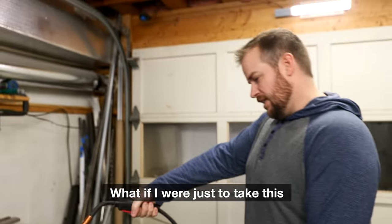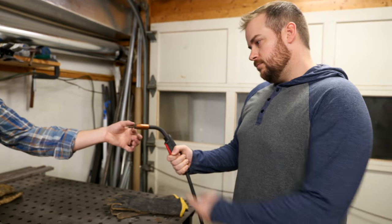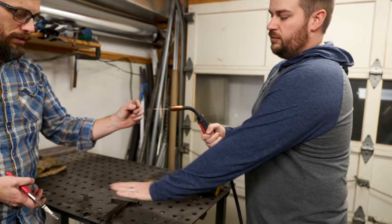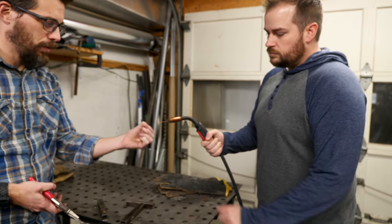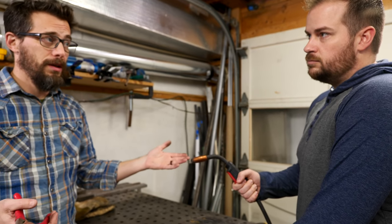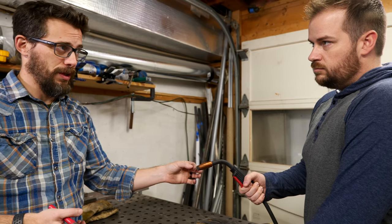If you were to take this and go real far back, it wouldn't work because the shielding gas is going to be coming out right here and it's not going to be touching down here, so it's not going to flood the area to get rid of the oxygen. The arc is happening from right here to the work piece and the gas would all be blown out. So if you work in a windy area, you need to shield this because the wind will blow that gas out even if it's really close.